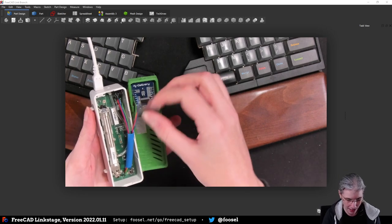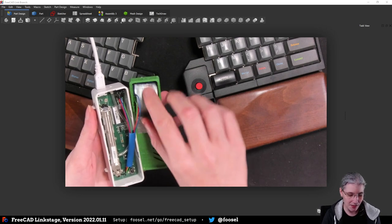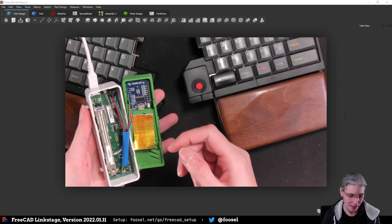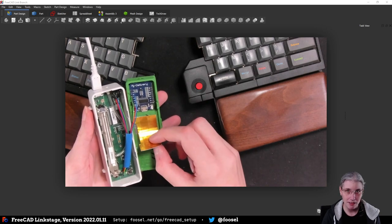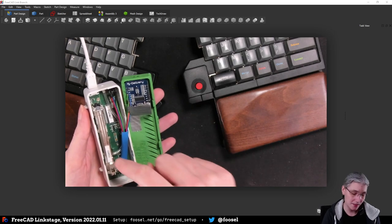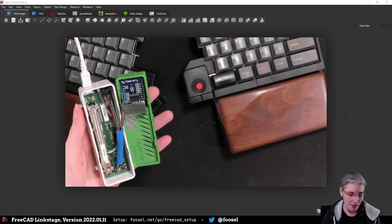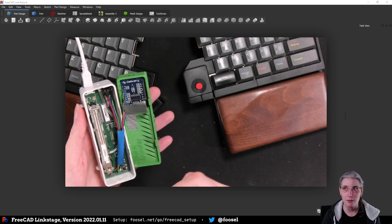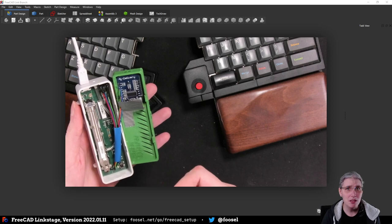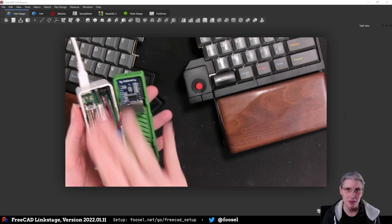You see that I already have a custom printed backplate here. But the problem is that I already made an attempt at isolating that thing, because it caused a significant temperature rise within the case, and since this thing operates with infrared, that caused the reported values from the sensor to go a bit nuts. Not nuts per se, they seem to be just a bit too low now, because the temperature in this thing is about 3 degrees higher than it was before.